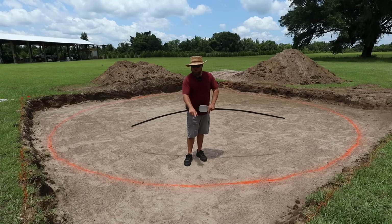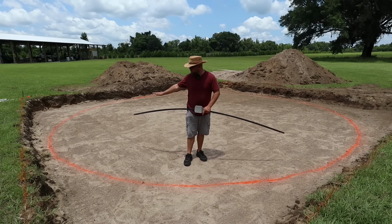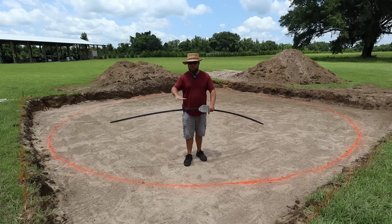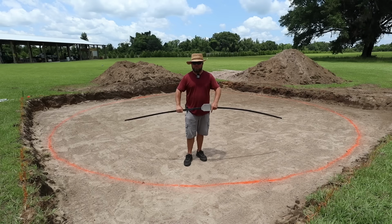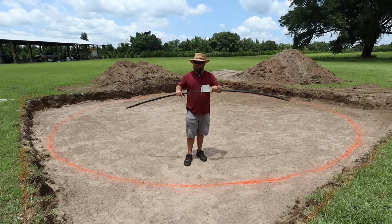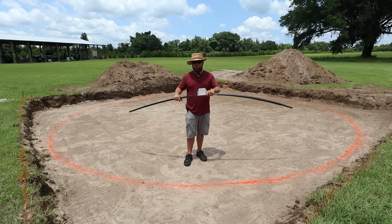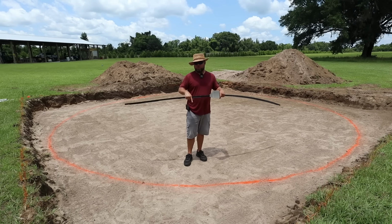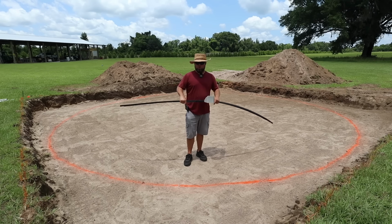But I have to make for sure those pavers that I put in are flush with the top of the dirt, because again, the wall is continuing to go out over the dirt as well. And this is why you wanna make sure everything's nice and packed tight. But I have been told by several people to really support these posts with a concrete paver down there. They're cheap, easy to install, and will really give me long-term support.